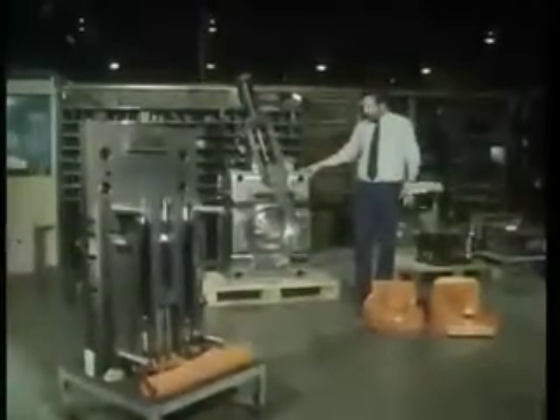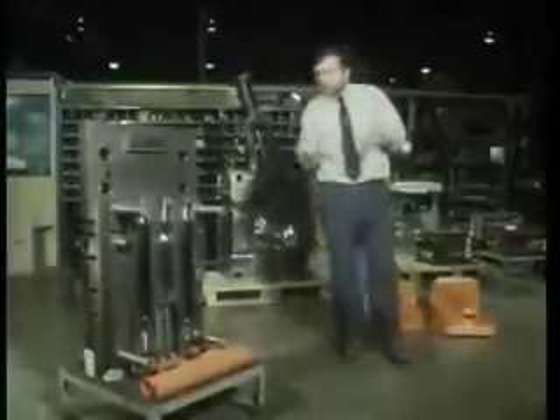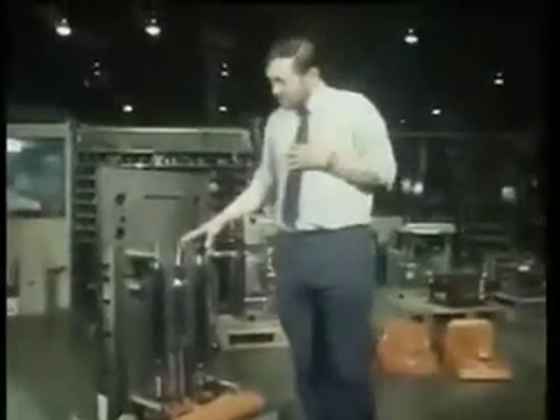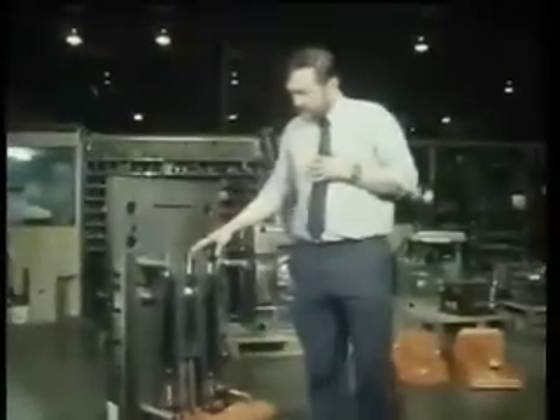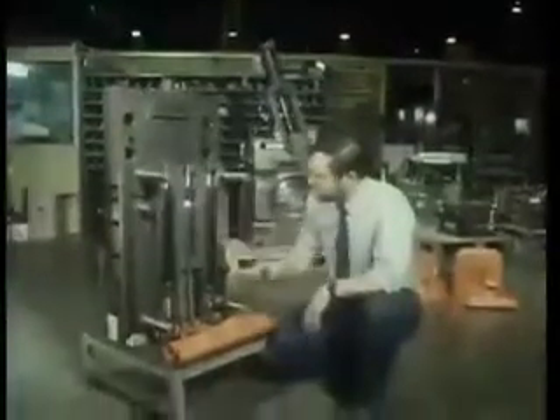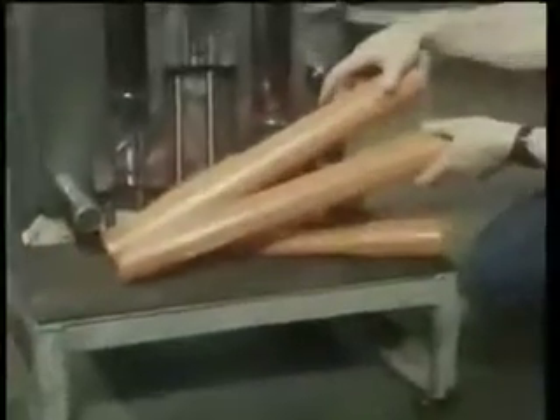This tool is actually quite simple in concept. A much more complex problem arises when a moulder wishes to produce more than one component from just one tool. At Flymo, they solved this problem using computer-aided design to produce three components in one tool. Essentially, the problem is one of achieving uniform flow of polymer into three quite different shaped cavities in the tool. The solution was to calculate the right gate size to feed polymer into each of the three different cavities.